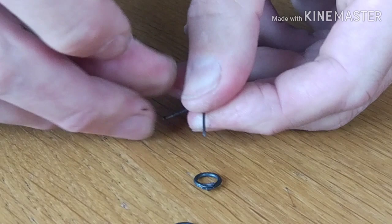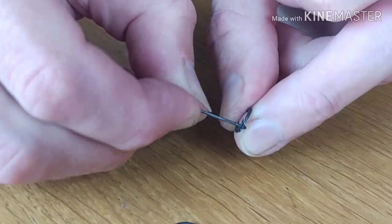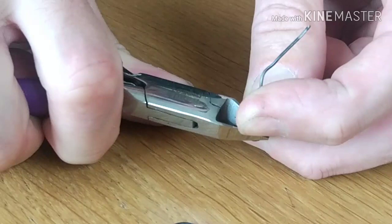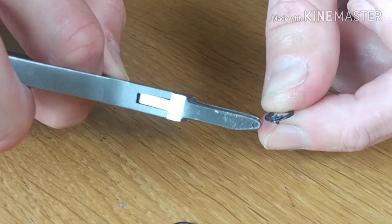For round or pin rivets, we take a piece of wire that's the right diameter for the hole and file the end slightly, because the drift is pointed. We place the wire into the hole and push it through so the end comes out just proud of the excess metal on the other side. The wire is snipped off flush to the overlap, making sure the wire doesn't spring away and fly off. You should have a short piece of wire poking out both sides of the ring. I'm using modified pliers with a hole drilled in one side, which allow me to push the wire through so that it's flush on one side.